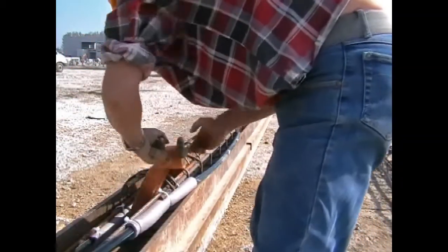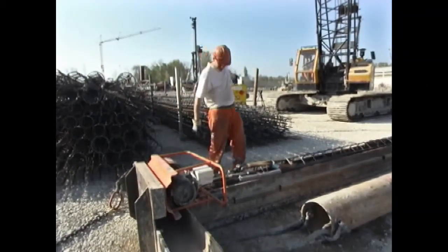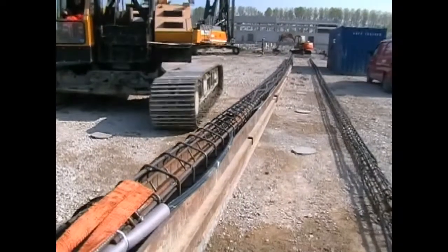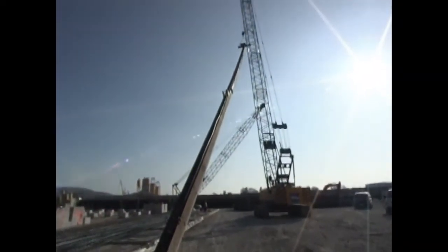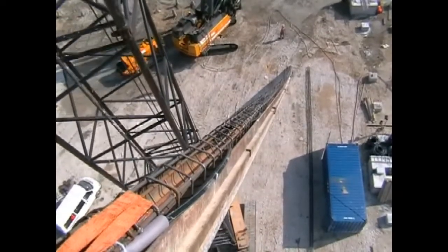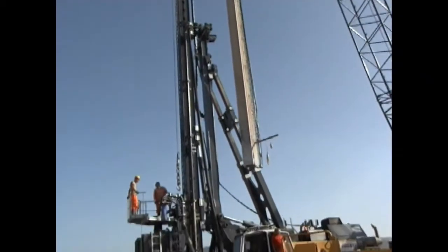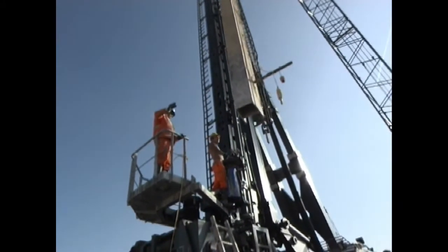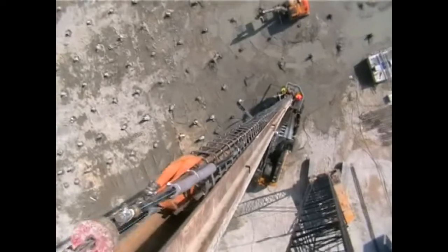After mounting of the hose, the reinforcement is lifted into a transport frame and fixed to an electric winch. This prevents the construction from bending during lifting. After the steel pipe has been brought down to its final depth by the ring vibrator and the workers have introduced the geotextile bag, the reinforcement cage is lowered into the pipe.